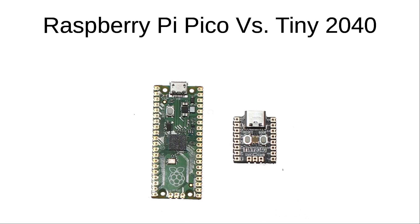There are a few differences between the Tiny 2040 and the Raspberry Pi Pico. The first and most obvious is the size — the Tiny 2040 has been designed to be as small as possible. It has only 8 digital pins and 4 analog pins, giving a total of 16 pins excluding the debug ones. It's also narrower, so if you're using a breadboard it gives you one extra row of holes.